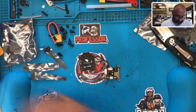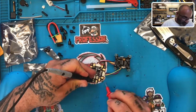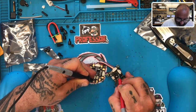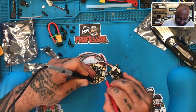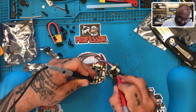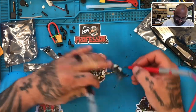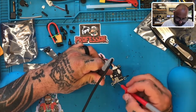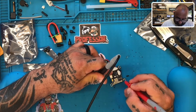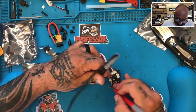I'm going to take a multimeter and put it on my current sensor. I'll start by touching the positive on what would be considered my battery here — and we're connected. Then I'll come over here and touch that. You will not get it here because there's actually a voltage regulator that changes the voltage to 12 volts right here. So if you want to bring your VBAT in, you come in here. If you want to bring in 12 volts, you come here. If you bring your VBAT in here, then you're good — no problems. I'll run the multimeter along the board to see if there are any other VBAT pads, and I don't see any.